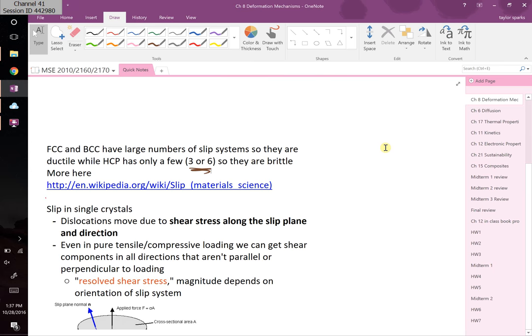Yeah, Antonio? So those slip lines are thermodynamically favorable methods for the dislocations. Yeah, and the reason why, we mentioned it earlier, is because moving along those requires less messing with atoms. So imagine atoms are people, as we've talked about all the time in class. If Matt is our atom and he wants to move out of this row, he would go along this messy direction right here. He would not go in some random diagonal direction, like climbing over Teak and Company, because they wouldn't like that, and that costs energy, and it's more likely to just fracture than do that, right? So that's what happens. Atoms are just like people.